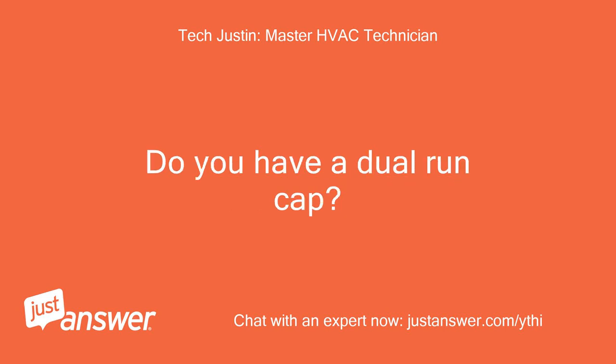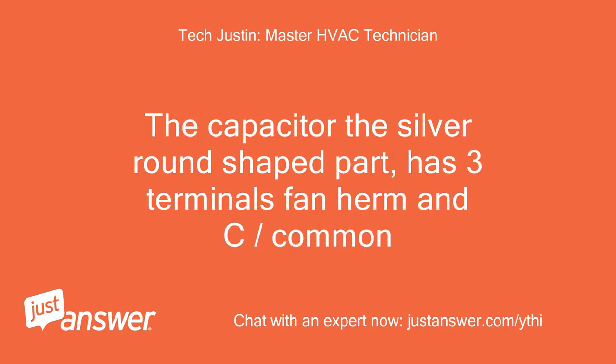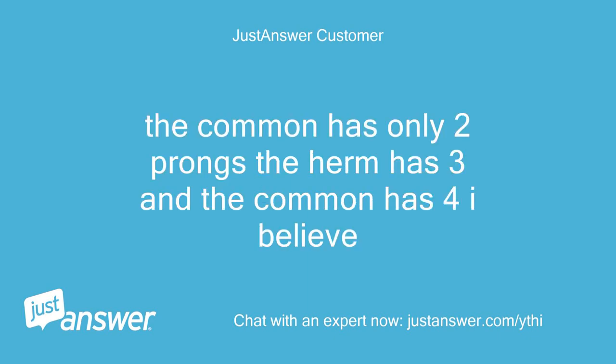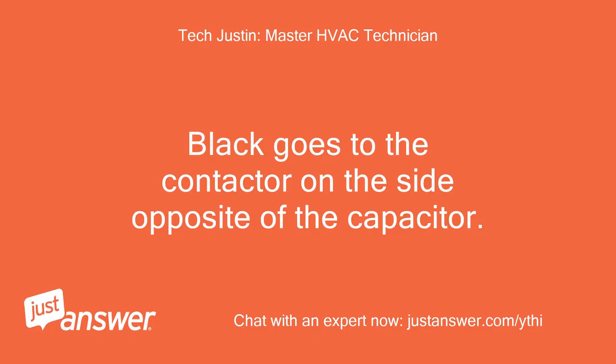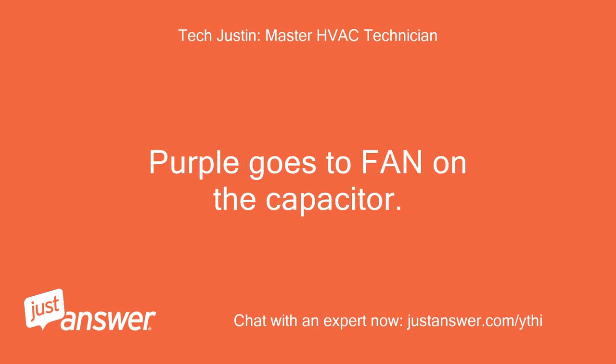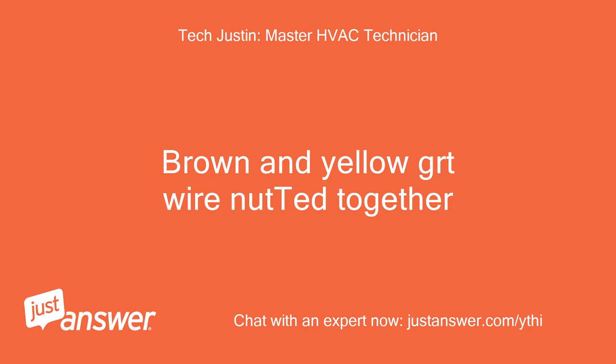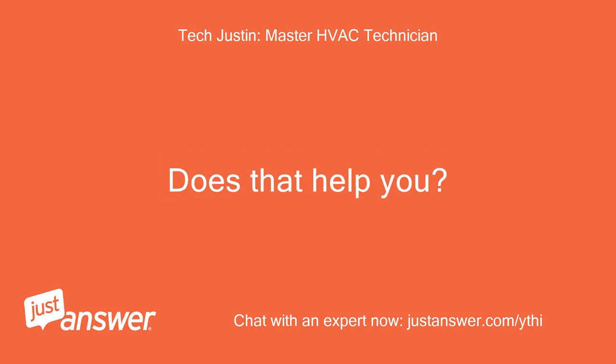Do you have a dual run cap? The capacitor, the silver round-shaped part, has 3 terminals: fan, HERM, and C, common. Yes. The common has only 2 prongs, the HERM has 3 and the fan has 4, I believe. Black goes to the contactor on the side opposite of the capacitor. Purple goes to fan on the capacitor. Orange goes to common on the capacitor. Brown and yellow get wire nutted together. Does that help you?